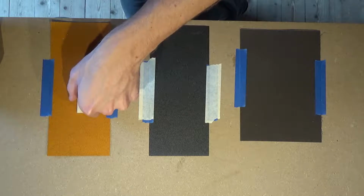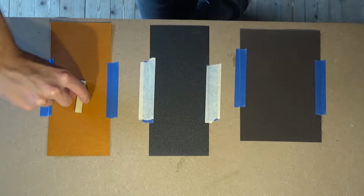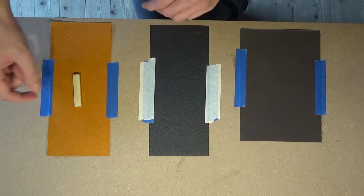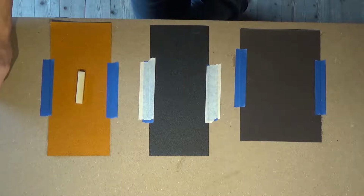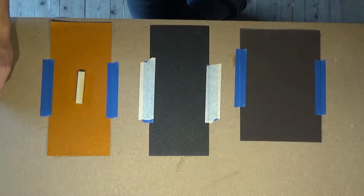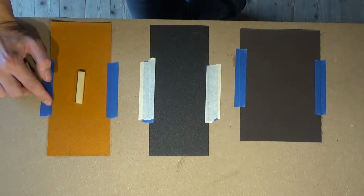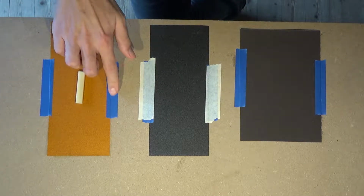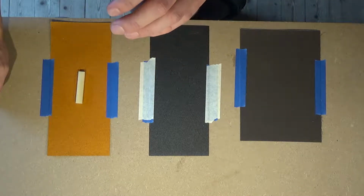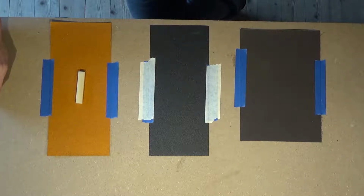and then I make sure to take the knot blank, let me show it here, take the knot blank and turn it around and do the same thing 15-20 times, take it back again, turn it around. It's just a basic little task to do in order to try and keep the knot blank as square as possible, and it's just going to make it easier for you when we get to clamping it in the vise, we know that it's still square and basically where we need it. So just loosely count 15-20 times and turn it around, flip it, and then just continue.